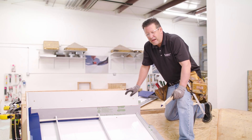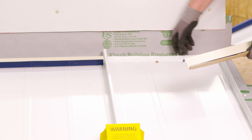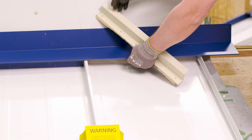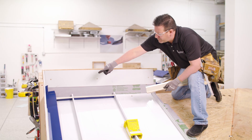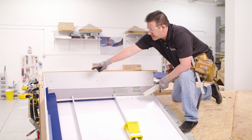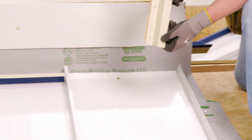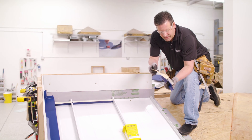Here we are on our mock-up doing the head wall detail. We've installed the panels, boxed in those panels at 45 degrees, and then set our head wall flashing in position and marked the lines for our Z-closures. I've installed the first two Z-closures set in the 3/16 by 7/8 inch butyl tape, attached at four inches on center max. If you've got a short piece, a minimum of five per panel on a full panel. We drill them out, get them set in place, and put the butyl tape on the Z-closure.